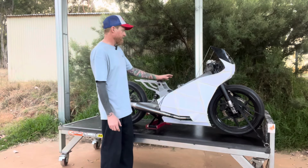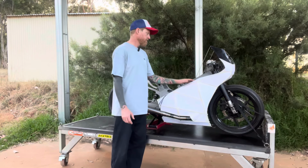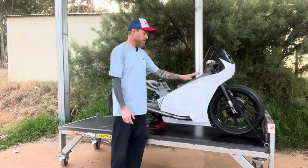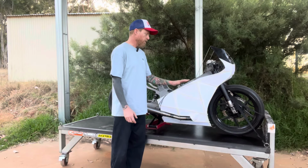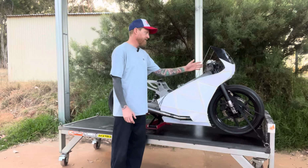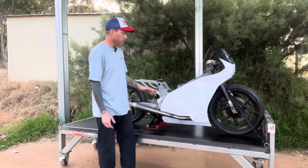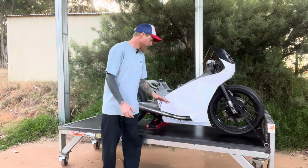So you'll see in the video me making the steel frame, the skeleton that goes to it. As I said, currently it's tack welded to the frame, but once I've fabricated all the aluminium panels for it, I'll then be making its own bolt-on mounts to the frame, and then this steel skeleton that I've made will be cut off and discarded, so that won't be there at all anymore. It's only going to be the alloy plate and the brackets that are going to hold that on.